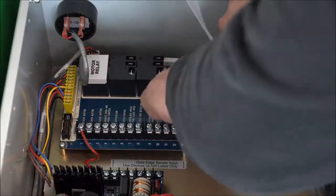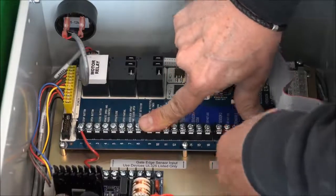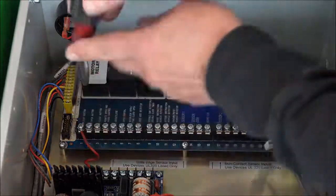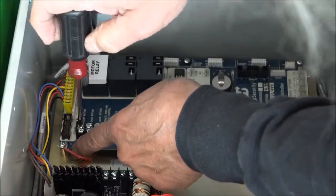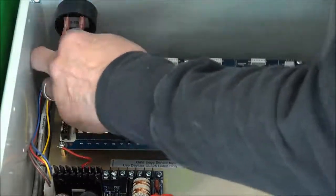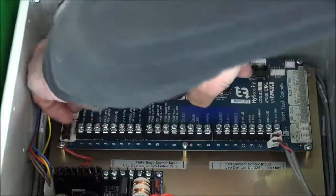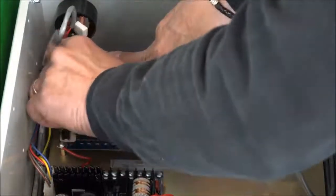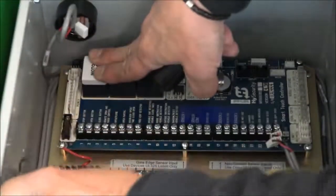First, the display keyboard cable. I'm going to remove the two limit switch cables. I've got a screwdriver handy here so I can remove the red jumper wire from that stop button. Okay. I'm going to remove this connector that goes to the stop button and buzzer. And then I'm going to pull off this big cable. Now this big cable, it's held in place by these little white connectors, so carefully pry that off of there. Got that off of there.